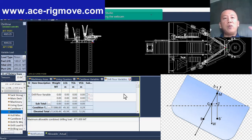If you have seen one video, probably you guys have worked with me before, I've shown you a video where one rig, you can see all the drill pipe falling apart, dropping on the rig floor, top drive damage, everything damaged. So what will this cause on the next operation? We have all this damage, can't continue drilling, right? So everything will be suspended, and then your spread cost will increase, everything will increase, just because you want to put 5 stands of drill pipe. The best is, regardless of what location, lay it off, put it on deck, that's it.